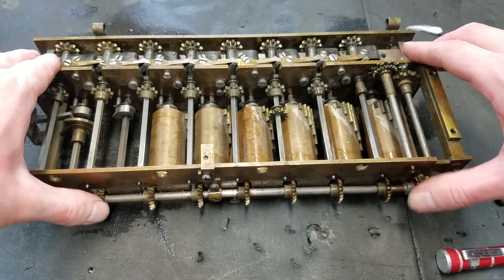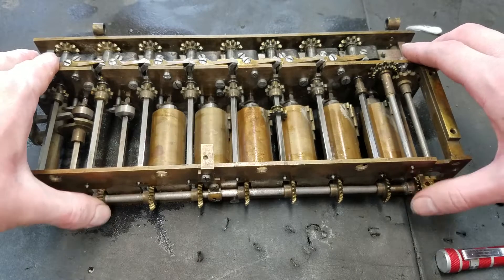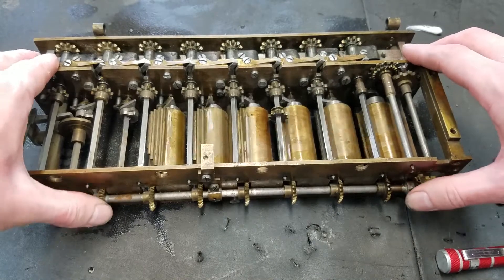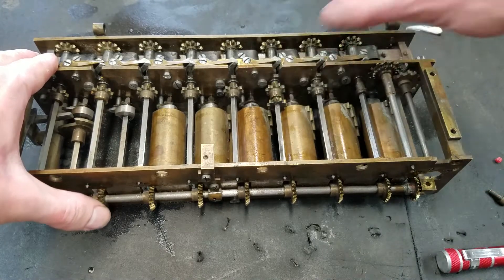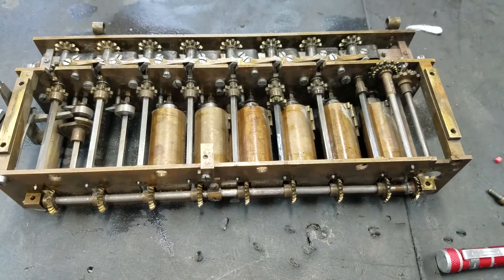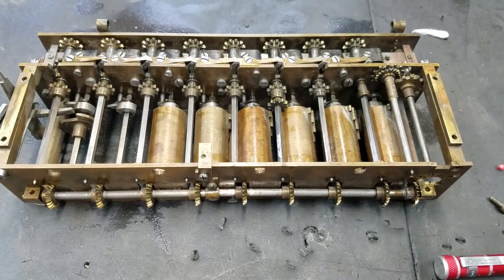So I think that was seven. By having the gear in that position, this should mesh with seven of the teeth. I think it's catching the bottom of the eighth tooth — let's tap this down just a little bit. So now it's going to mesh with seven of the teeth on the Leibniz wheel. And if I wanted to do nine, when I set the finger to nine, this would be all the way up here — it's going to mesh with nine of the teeth on the Leibniz wheel. All the other columns are set to zero, so you can see the gears all the way down there not meshing with anything. That's the basic principle of how you select and add a number.